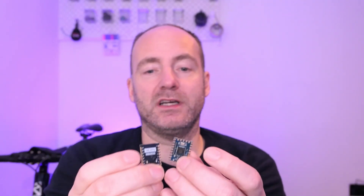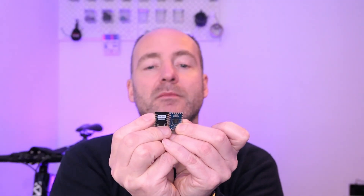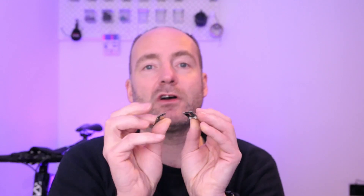But in the comments of that video there were loads of suggestions on other things to try, and one of those suggestions was this — an ESP32 C3 Mini. It's really tiny. Just as a comparison, it's almost identical in size to the Pico Zero. Both have USB-C which is really convenient. This doesn't have the RGB LED, but what it does have — which is a lot more useful in my opinion — is Wi-Fi and Bluetooth, whereas the Pi doesn't have that. So this is potentially a lot better and it's a similar price.